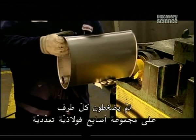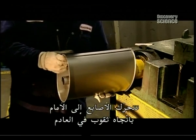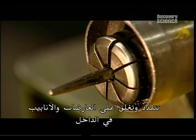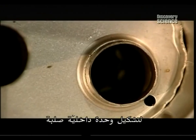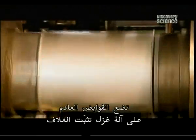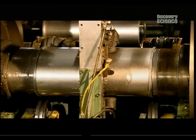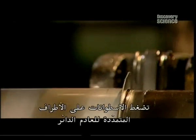Next, each end is pressed against a set of steel expansion fingers. The fingers move forward into holes in the exhaust, expand, and lock the baffles and tubes inside to form one solid internal unit. Grippers then place the exhaust on a spinning machine, where rollers press against the flared edges of the revolving exhaust, tightly locking the end cap to the rest of the body.